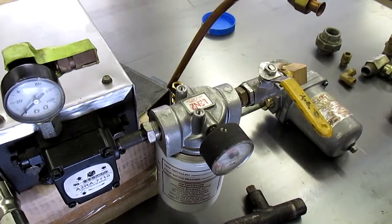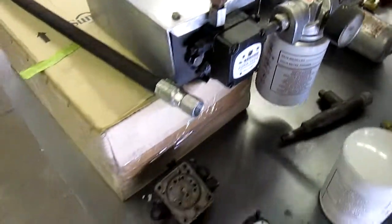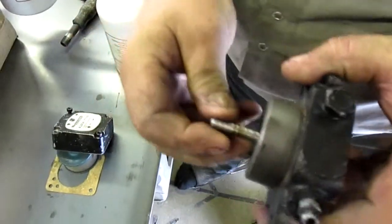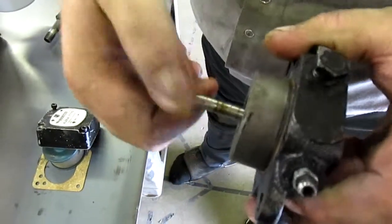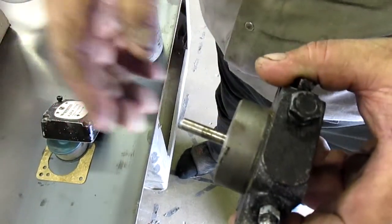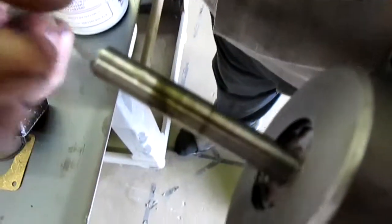While the pump holds vacuum, push the pump shaft seal sideways. This is the pump — push the shaft seal left and right, up and down, and sideways. If the vacuum totally disappears suddenly, then you've found it: the shaft is worn.